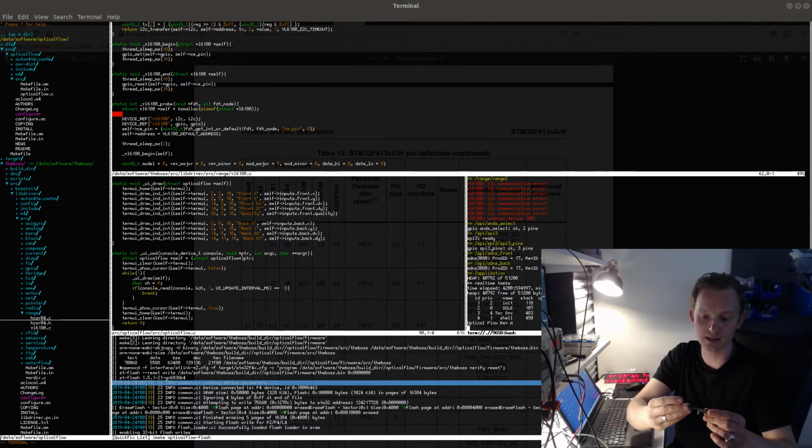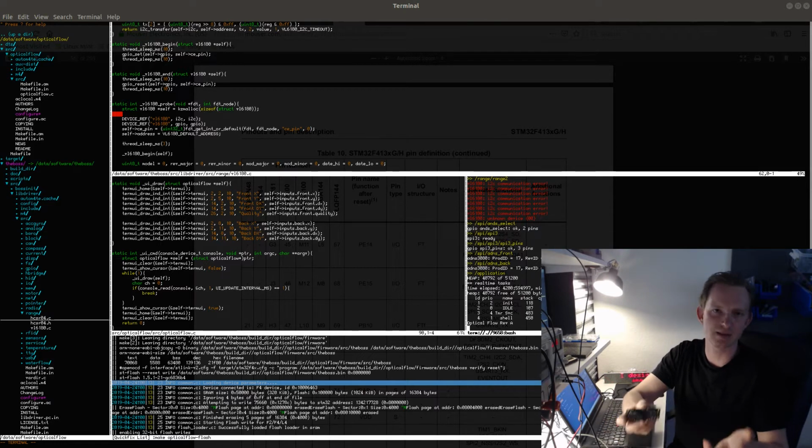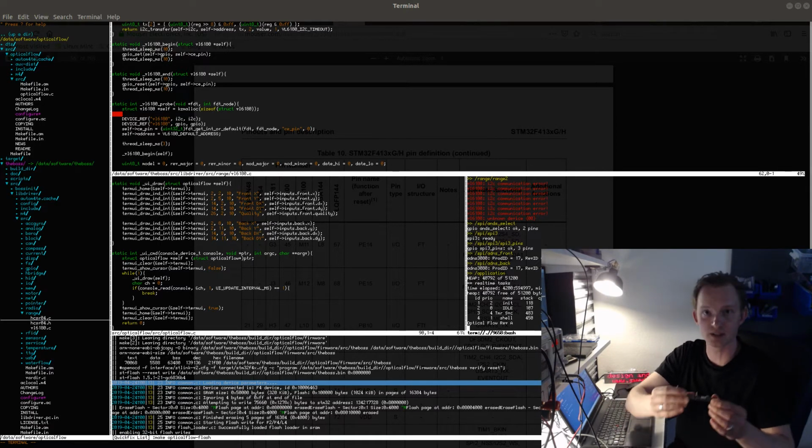In order to do that, all I need is essentially just to wire the SDA and SCL lines between the I2C buses. So I'm going to have 2 jump wires going across the board and connecting the other 2 sensors to the I2C1 instead. And that should let me read all of the sensors. I may still be able to take readings in parallel, but I wouldn't have true parallel operation of the sensors. I wouldn't be able to actually write the I2C commands in parallel. But that's okay. I think for this test, that's going to be sufficient to do all of the testing with this board before actually fixing all the faults and making this into a production-ready board.